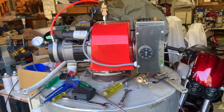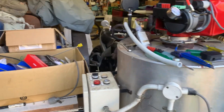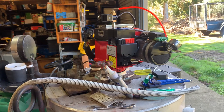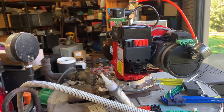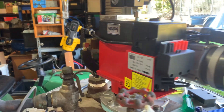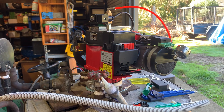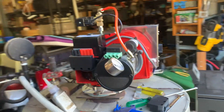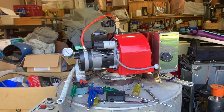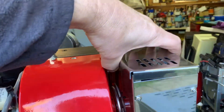It's going to be really interesting to see how this burner goes — it's rigged up for 50 kilowatts. The boiler says 75 kilowatts but I believe that's a steam-related figure, not the size of the burner. This burner appears to be the same size as the one originally on it. If you've got a top-fired boiler and you need to convert it to waste oil, and if this is a successful modification, we will do special orders for this type of burner. Check out the website at www.westernthermotechnics.com.au — that's our business name.